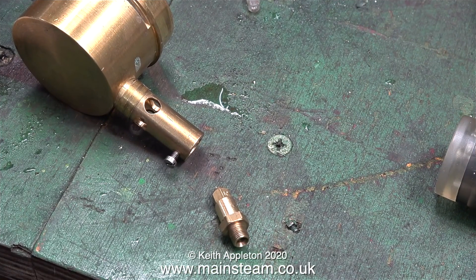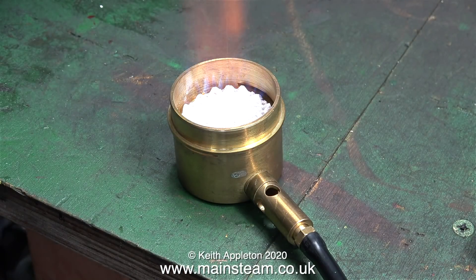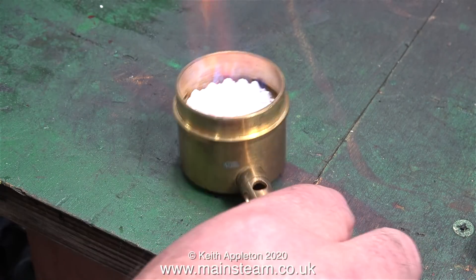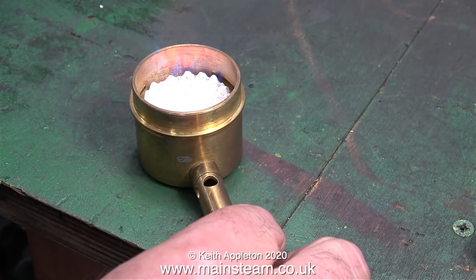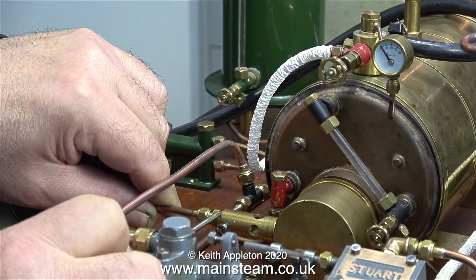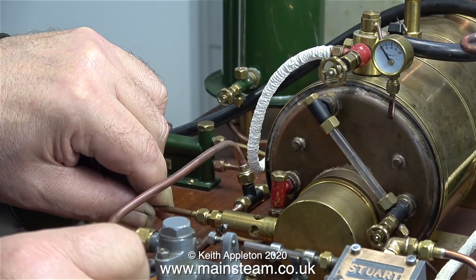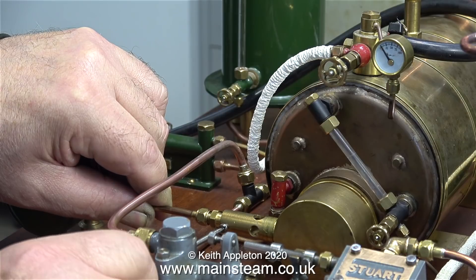Because the pump is working fine now and the gaskets are not leaking steam at all, I'll have a look and see what size burner jet is in the gas burner. It's a number 10, and number 10s are a bit too big for this. When I light the burner on the bench it gives a good flame, but when you put it in the flue it's a different story — inside a close flue it doesn't get enough oxygen. I'm refitting the burner into the boiler, and I've pulled the jet out as far as I can in an attempt to create more turbulence over the venturi holes.